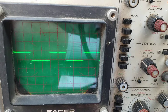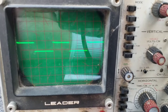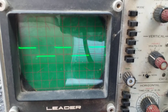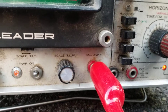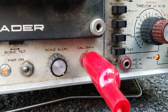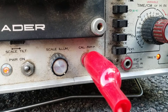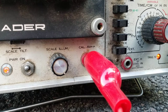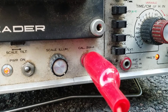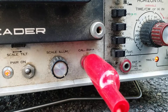What about other measurements like frequency, measured in 1kHz? Coming back to our terminal — it may or may not be listed on yours; check the manual or internet if needed — I believe my scope puts out a 1kHz square wave with an amplitude of half a volt peak-to-peak.